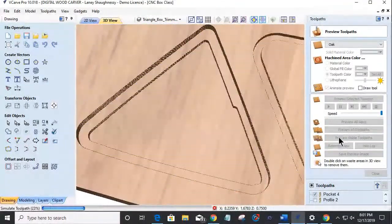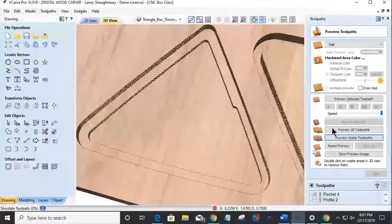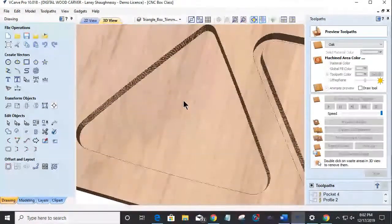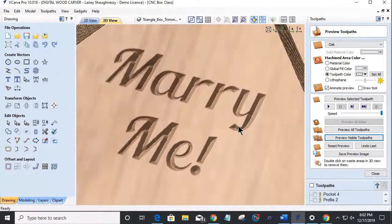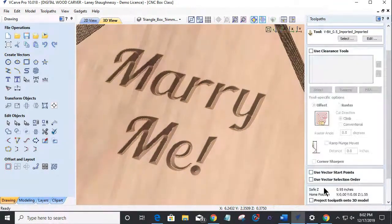This is without the 20 thousandths of an inch additional start depth. And my 0.375 is the start depth for the simple fact that that's my lid, I'm popping it down. All right. So let's say my carving, my Y or my E or something, didn't show up very well. Well, I would give myself that additional start depth. So I'm going to go ahead and change this to 0.395. I'm going to recalculate this.